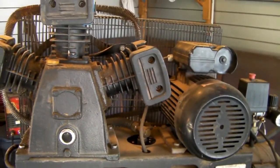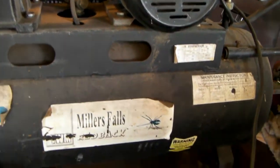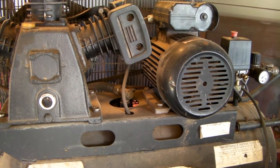Before you try and drain it, turn the compressor on. So I've turned my compressor on — as you can see it's going. What we want to do is charge up the tank until it gets a bit of pressure in it, so it blows the air and water out of the valve on the bottom of the tank. Just wait a second until she stops and then we'll have a look. There we go, it's just stopped.